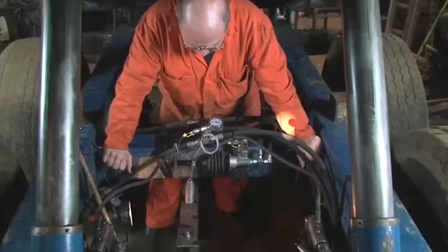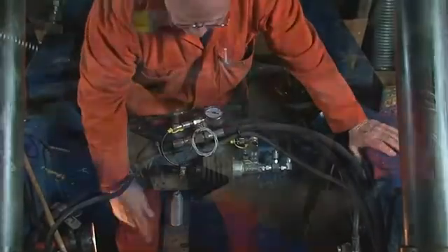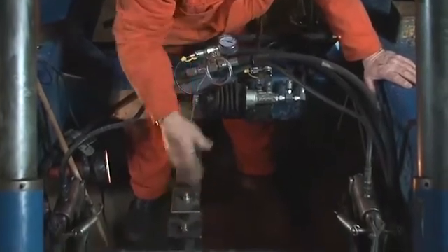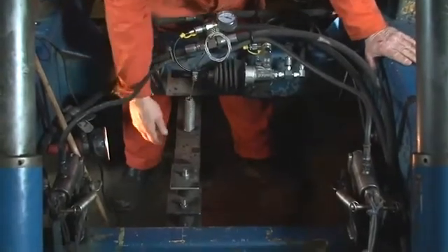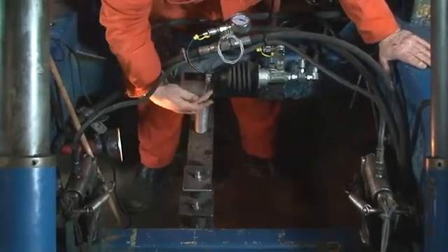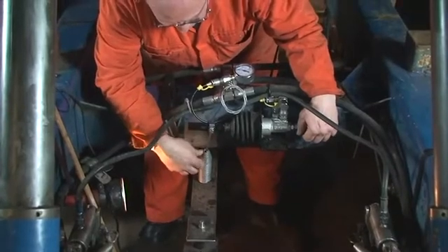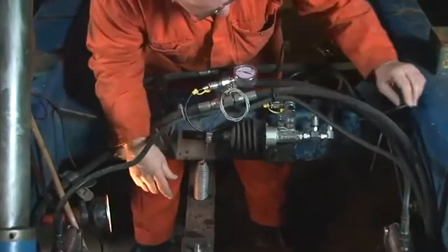Not all trailers will be the same. We've got a balance beam that runs from the front axle to the rear axle, using rubber bobbins which absorb the torsion and torque of the axles. On undulating ground it has the flexibility, giving less chance of breaking the arm off. Incorporating the load sensor valve — this piece of kit here — you have a spring which acts as a shock absorber and a cable. You may think, why not a solid beam? Well, axles move around and therefore the cable will move relevant to its axis.